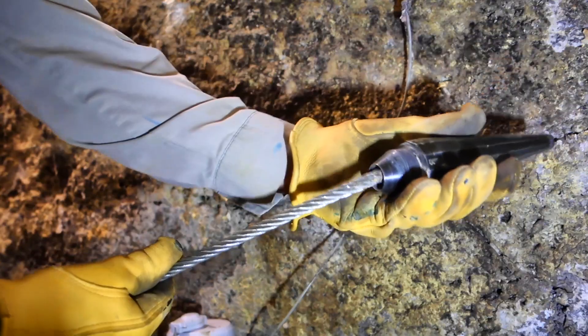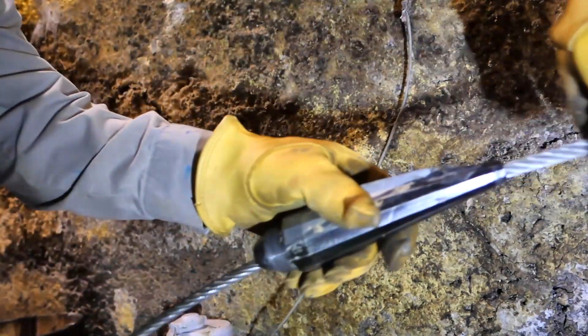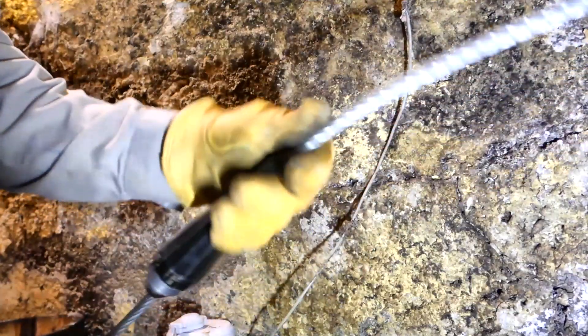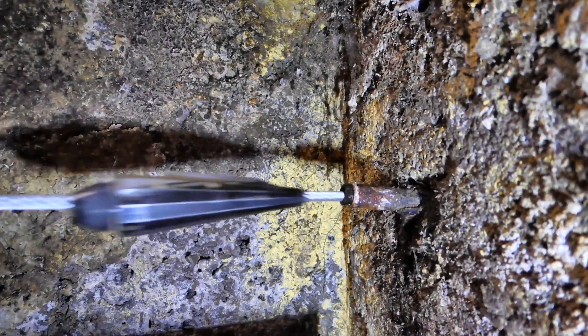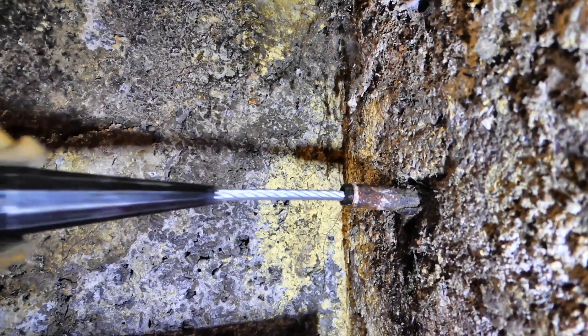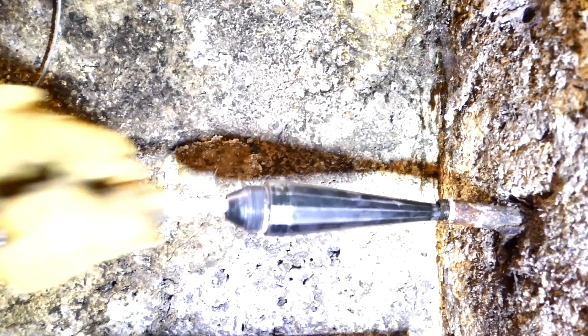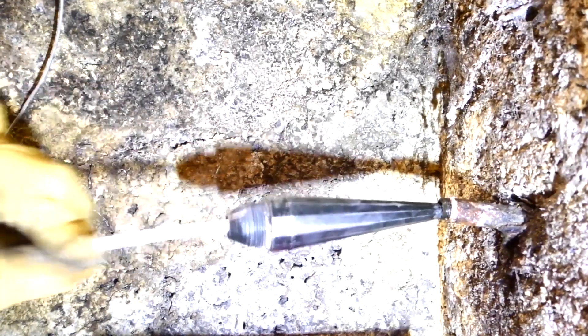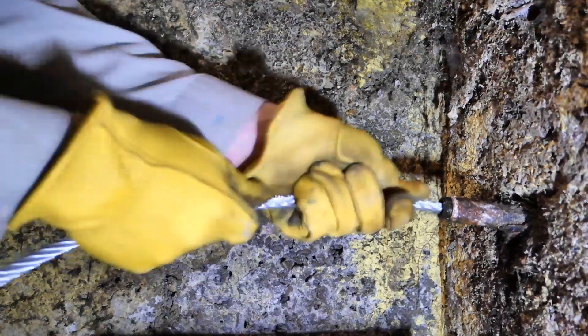This is actually the wedge cone that feeds onto the cable before it's pulled through, because at the end is a swedge and that's what does the pulling power on this wedge head cone, whatever you want to call it. It does have a slicing knife, but that's really only helpful mostly for copper and plastic, but in many instances it will split apart this galvanized line on its very own. Sometimes if they are newer and still in decent shape it won't do that.